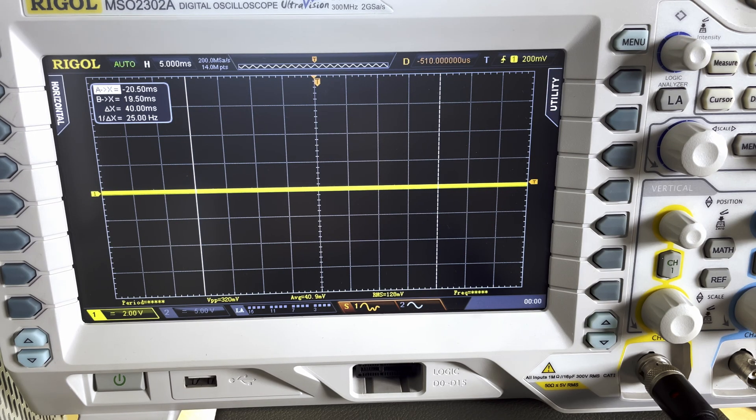We're going to look at the servo pulses and see how they change as I get closer and farther away from the sensor. You can see those pulses happening about every 25-ish milliseconds apart. As I put my hand closer, you can hear the motor change pitch, and you can also see those pulses come closer together. Pull it out and there we go.